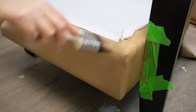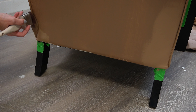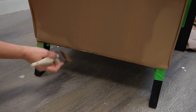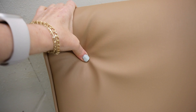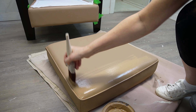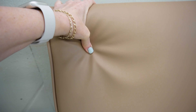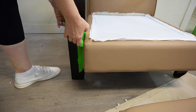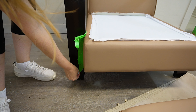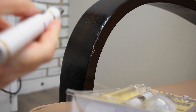Once the first coat had dried, I masked off the legs and arms and painted on my second coat. Depending on how thick your paint is or what brand of chalky paint you're using, you may want to use a water mister to dampen your brush or spray onto the furniture when applying the second coat, because it won't glide on quite as easily once there's a base coat on there. I misted my brush a little before dipping it into the paint, and when it felt a little too thick I added a light water mist and kept painting. You may or may not need this depending on the thickness of your paint.